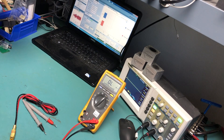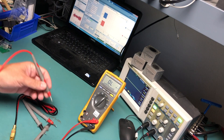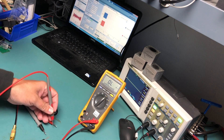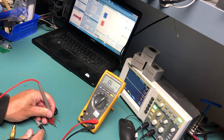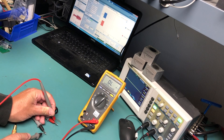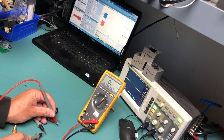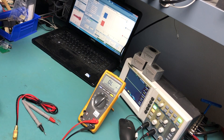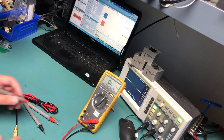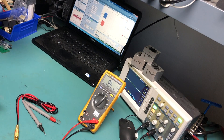The last test would be to make sure that the DD-1 probes are not shorted inside. Take our meter leads, one to the red, one to the black, and just make sure it says open. That OL means overload, which means it's higher than the meter can read, so it's open. There is no connection between the two probes, so that's exactly what we want.